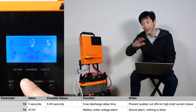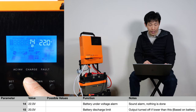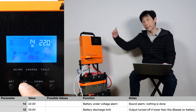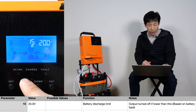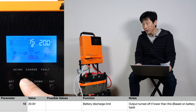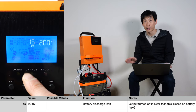You want the delay time to be long enough to sustain momentary loads. The 14th parameter is the battery under-voltage alarm — this is just an alarm. If the battery happens to be lower than this, it's going to start beeping. You can lower it all the way to the battery cutoff voltage. The battery discharge limit is the hard discharge limit, and I've set it to 0% of the battery, which is 20 volts. This is pretty harsh on the battery — you probably never want to go there if you have a choice. At this voltage, everything is going to turn off to prevent damage to the battery.